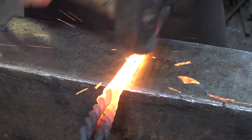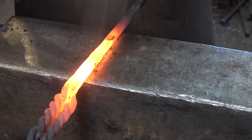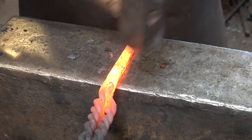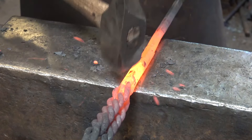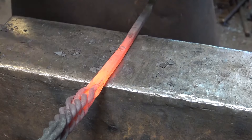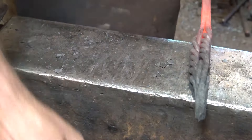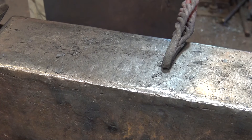Even the weld out — don't work too much right in there or you'll end up making a thin spot. This is a taper. Weld at the 3/8 bar up into there, weld at the twist. Notice I keep that twist all the way off the anvil so that I haven't damaged it. That'll make a nice fireplace poker or something like that. I think I'll go ahead and draw this out and put a little ring on that end before we finish the twist, and then it'll just be done.